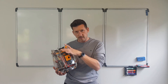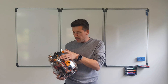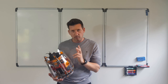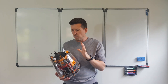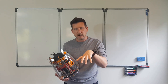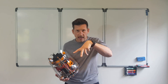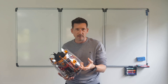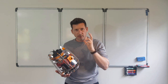The arms will sit on the outside, shaped to fit concentrically around the body of RR01, and they'll hinge down and out to three wide points. Three points is better than four because a tripod naturally finds stability — with four legs you can have three touching and one not, causing pivoting, and you'd need suspension to fix that.